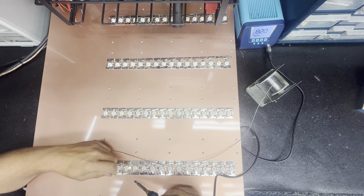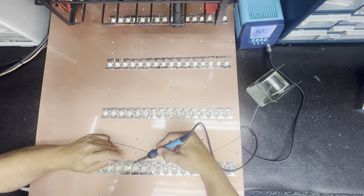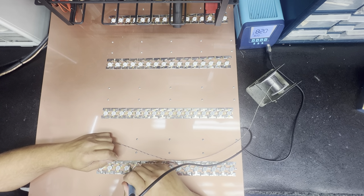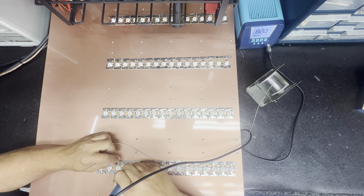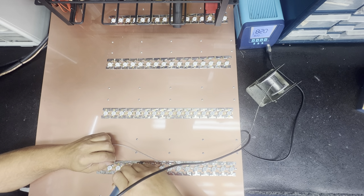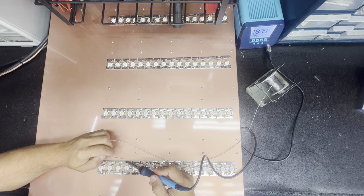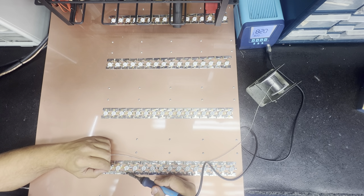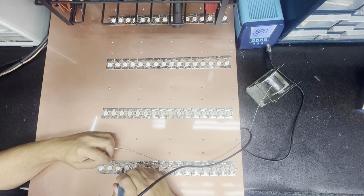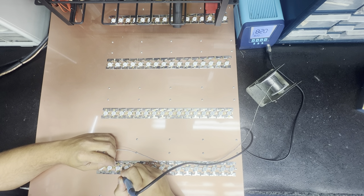I gotta build half the power supply for him to run this. Probably gonna run it at 15.8. That way he's got the option to go up. A lot of times guys ask, why don't you turn your power supply? Well, if you don't drive it hard, okay? You can run it on a lower voltage. It just depends on how you drive it. Like Charlie, I say set on 15.5, he can drive it easy and do good watts. Then if he wants to knock it on up there, he can. You have that option. That's why I said 15.8. If you want to be easy, I'll drive it easy. Simple as that. But you always have that option to go up there on power if it's set on 15.8.